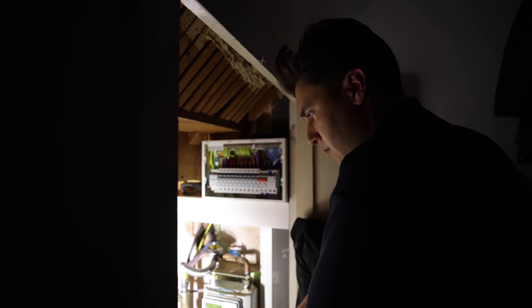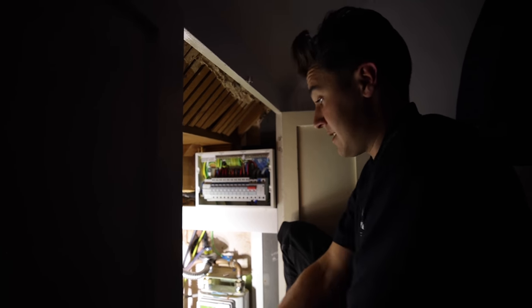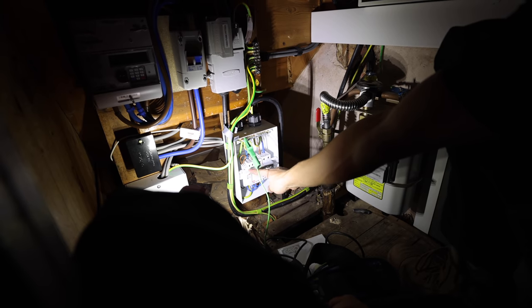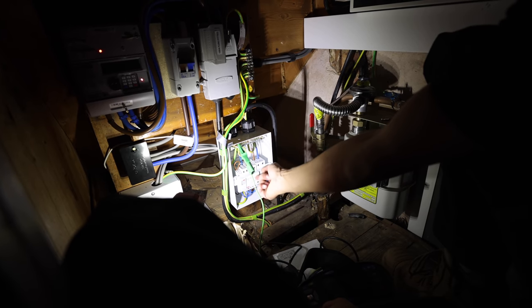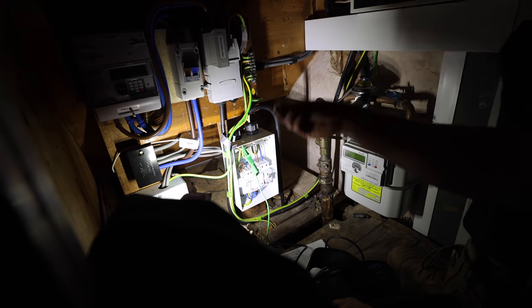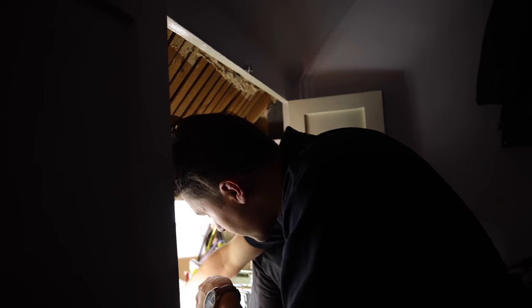That's all tested on this side — I need to do a couple of little bits on the other side still. Just to explain: this device here is a PEN fault detection device built by GARO. It's got a type A RCD, and this big contactor here is monitoring for PEN faults — if it detects one, it opens up the contactor, breaking all the different conductors. Good job I talked through that, because I nearly made a mistake: you see an earth, you put it in the earth bar on autopilot, but that's not correct. You want the contactor to break the earth in the event of a PEN fault — your protective earth neutral conductor becoming live.